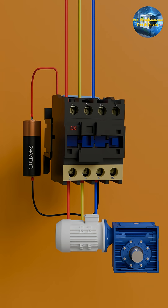And as we disconnect the 24V being applied to the coil, it will de-energize the coil, and the contactor contacts will be disengaged, thus cutting the power being supplied to the motor. And the motor stops. So that's how the contactor works. Follow us for more electrical basics.